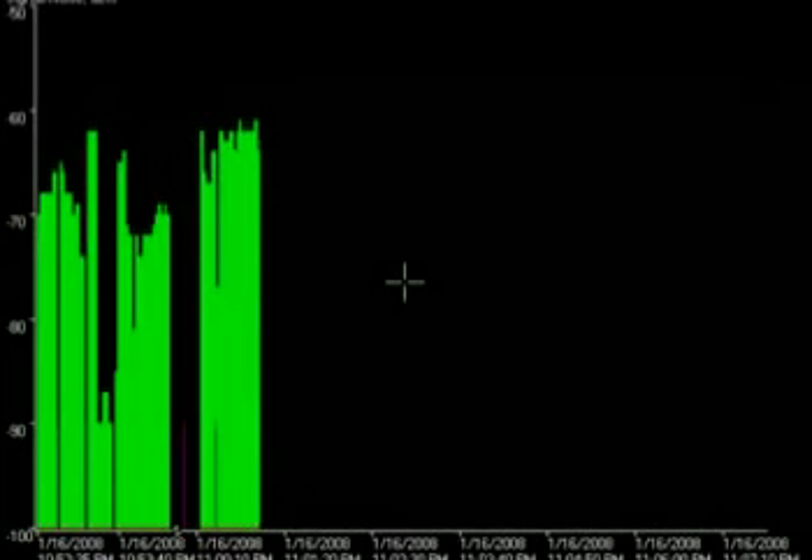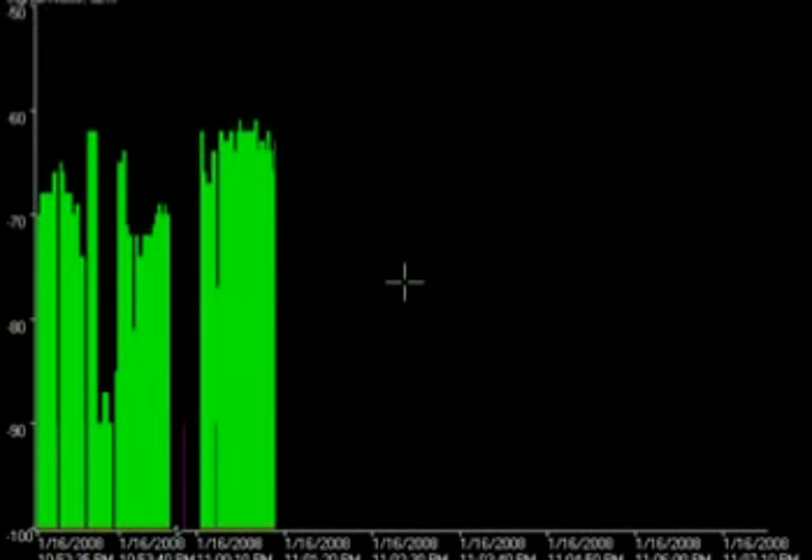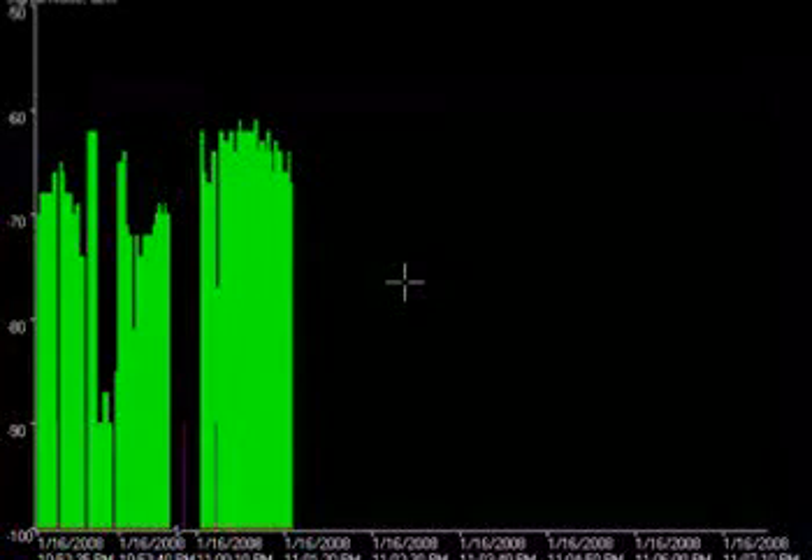And if you notice, now that I've had this new antenna, there aren't as many gaps in the radio signal. So when you're making an antenna, you're not just increasing or decreasing the signal strength itself — you're also increasing the link quality. You're making it so there's no more gaps and no more breaks. So this is just the first part in a multi-part series. If there's any questions or comments, or if you have anything you need to ask or would like to say, I know that I didn't cover everything — there's always the next episode.